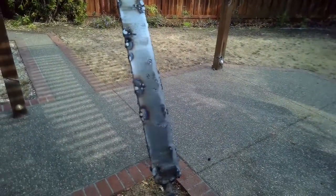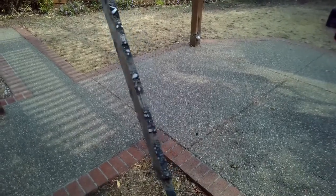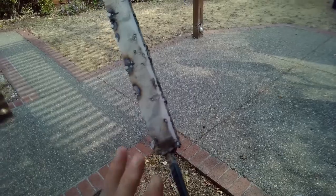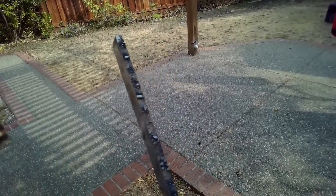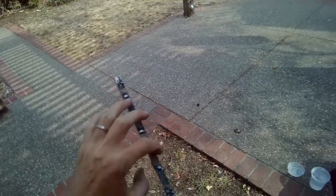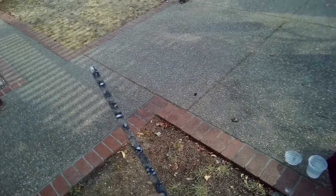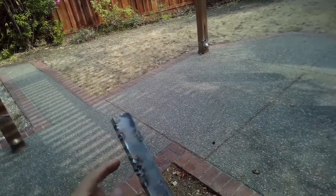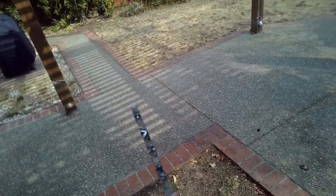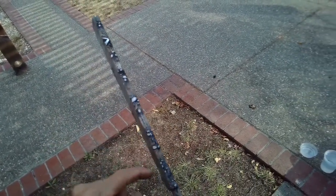This is my first welding attempt with the MIG welder, and some of these are really awful looking and won't even work. It was able to get the rebar stick on there pretty good. When I used the hotter settings on the Vivo Home MIG welder — the hottest settings it had — and took more time, I was able to get a continuous bead that would hold all three layers together for Damascus. When I went too fast it seemed like the nickel plated sections needed to get hotter to weld properly. By going slower with a hotter setting, I did get a few continuous beads. When you grind these off you can see a bit better — that'll hold for sure, that won't, that might, that will — we'll see.